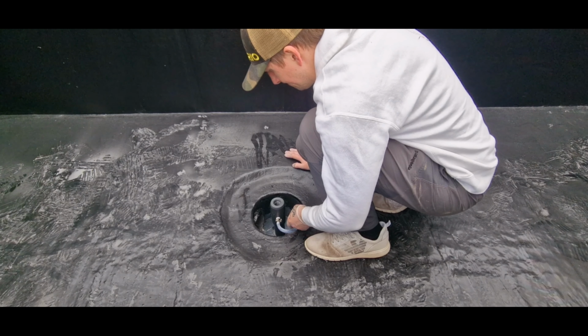Water that will come down out of the drum into the 20,000 litre per hour pump into here. Split to here, straight through to here, and then split to here for three returns. I'll have the one that's straight through, which will be pushing the most, for the shower, because that'll be in the middle of the pond, so it's the middle valve. This one is the nearest return.